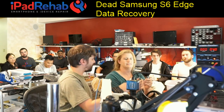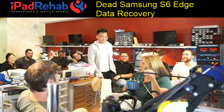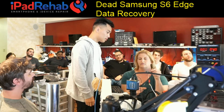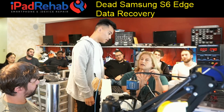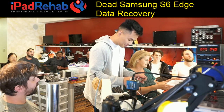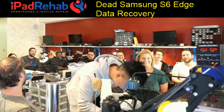I want somebody else to confirm. Which one of you is brave enough? The challenge: somewhere in here is the short, and you're going to find it with heat by holding your face close to the board after connecting to ground. It's cooled down now, so connect this to the corner to start the current and find the hot spot. The customer specified there was never any urine on this phone. The customer never lies.